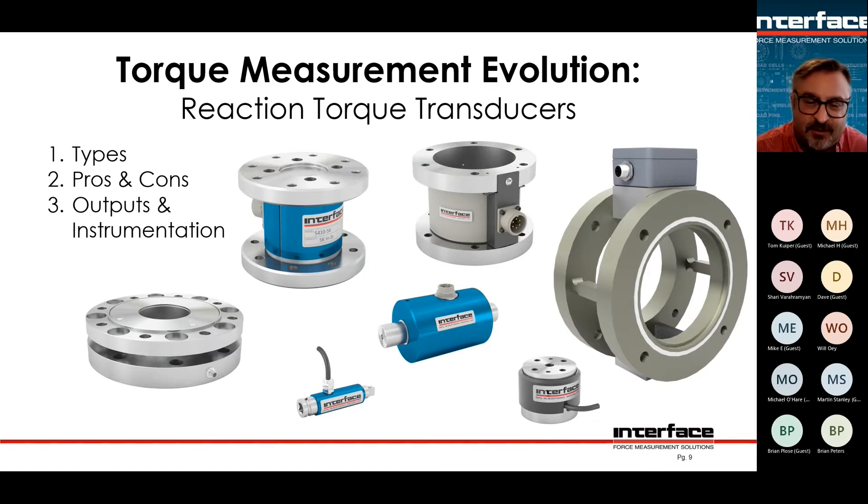Some sensors are designed for a specific purpose. Looking at this picture here, the bottom one is relatively short for its capacity, and it has a through hole, so it's good for a short installation. This one has a bigger through hole but is also taller, so it wouldn't fit as well in tight spaces. And this one has a giant hole through it — it's designed specifically to mount to a certain type of motor called a C-face motor.